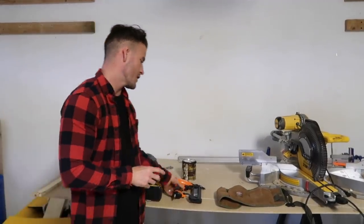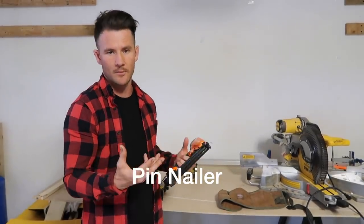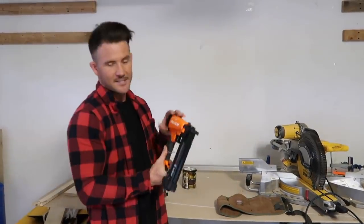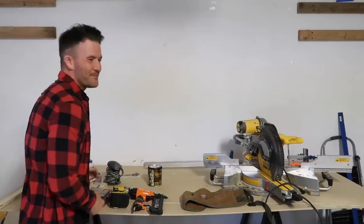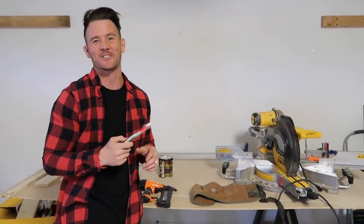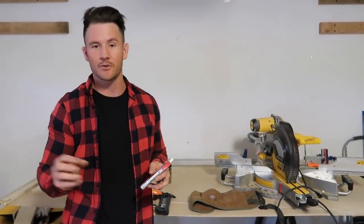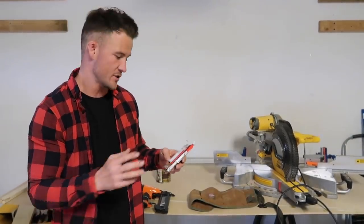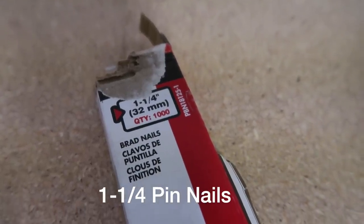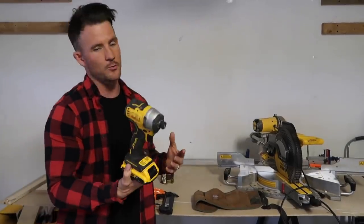The second tool you're going to need is a pin nailer. I always use a finish nailer with the smaller nails because you want them to be more hidden. The nails I had were two-inch nails, which obviously won't work when you're using one-by-fours — they're actually only three-quarters of an inch thick. So I had to get inch-and-a-quarter pin nails so they'd sink in enough but not penetrate the other side. It's very important you get the right size nails for the job.